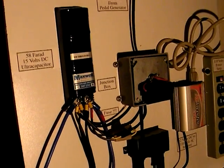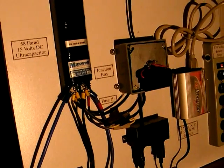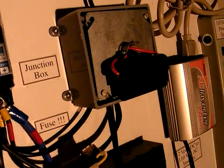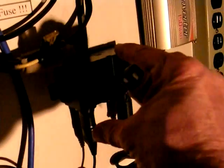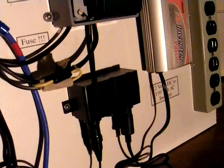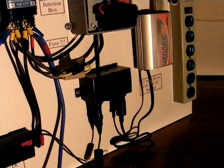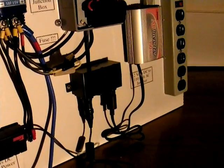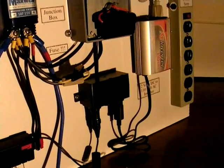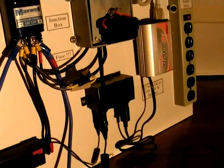The wiring looks intimidating but really is not at all — it's very simple and it's a practical setup. The only thing I might do differently if I were to do it again is leave this wire a little bit longer and rotate the cigarette lighter adapter so the outlets face either left or right. As it is, occasionally if these aren't plugged in tightly they'll fall out, because gravity is working against the layout of the cigarette lighter sockets. But when pushed in firmly they work pretty well.